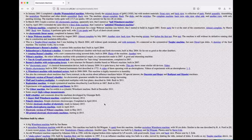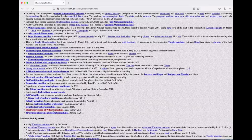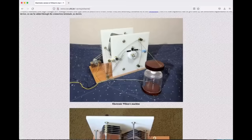The ones I really want to pull your attention to are these electronic versions. He's done a lot of research and made many electronic versions of electrostatic machines capable of harvesting energy. This one is the one that really started me off — the electronic version of the Bennett's doubler. The Bennett's doubler is an exceedingly simple induction machine, and he built it with a series of 1N4007 diodes going up to 5 kilovolts, to harness the microamps gained just by moving a disk between two disks as a variable capacitor. Absolutely genius!